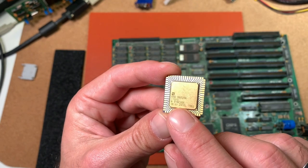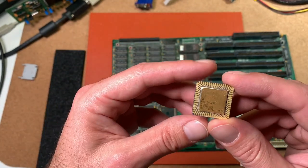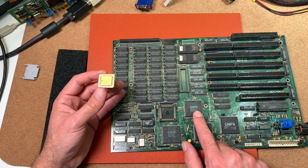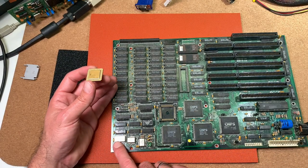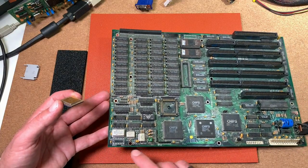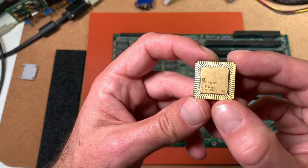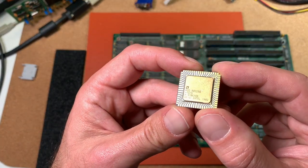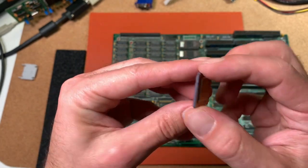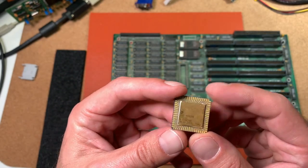Actually with 10 MHz — so it's interesting. Seems to be that it's the original CPU which was inside. The board is obviously 12 MHz. We have here also a crystal with 24 MHz, and it's divided by 2 for 12 MHz clock for the board. So actually it seems that they were overclocking this CPU. Interesting. But we will see later on, when we check with some benchmark programs, what is going on here.